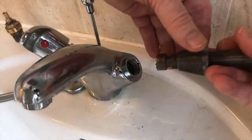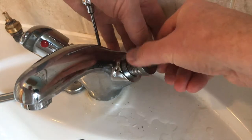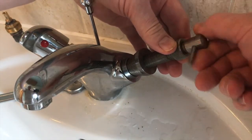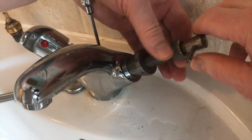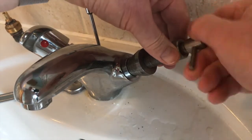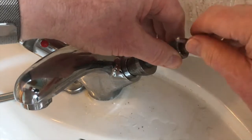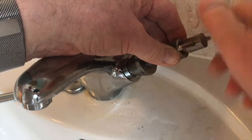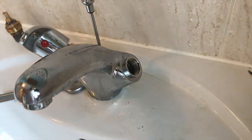The way to use the reseater is to wind this barrel back so this part is short, then put the large piece in there and screw it until it's tight. If you hold this collar and turn, it just spins. Now gently turn this part until you start to get some tension. You can hear it — it's basically just grinding any light scale off that surface. You don't want too much or it'll take too much of the brass off. You do want it smooth. Then unscrew the big one and it comes away, and we should have a nicely cleaned surface inside.